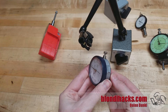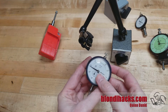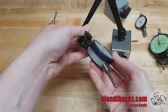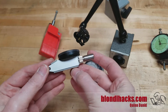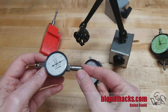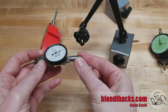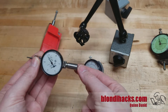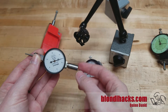Dial indicators typically have a lot of ways to attach them to things. There's often a lug on the back for a bolt, and there are often little dovetails which fit into the NOGA arm — a very convenient way to quickly attach and remove them. On the dial test indicator, there's also a long dovetail and a precision ground shaft. This guy can attach to the NOGA arm, but because it's a precision ground shaft, we can also put it in collets on the mill or all sorts of other precision fixtures. This shaft is often the most used form of attachment for the dial test indicator.